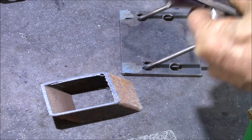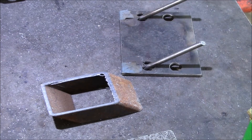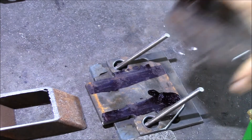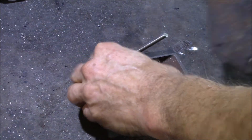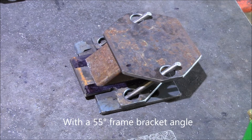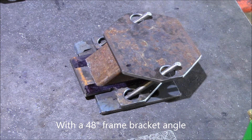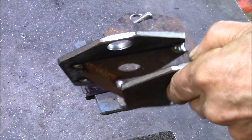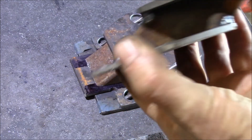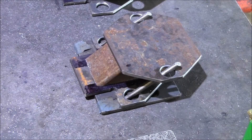So I have those parts, and then I have these parts that I make. They get cut with various angles and notches, and they fit onto a jig like this that holds these pieces at the proper angle. That's basically a spacer that goes in the middle. We call them our motor mount spacers. This particular one is for the Toyota four-cylinder engine, the 22R and 22RE. We also make a version for the V6 — the three liter V6 and the 3.4 — and that also fits the 2.7 liter four-cylinder engine. We clamp them up and tack weld them, then go through and weld all the joints, and that makes up a motor mount spacer.